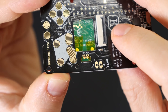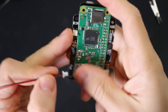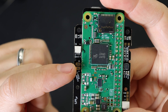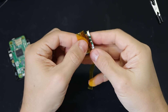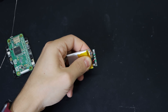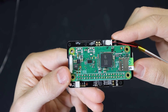Now add a little bit of solder to these pads around the Kapton tape area — that's so the microcontroller on the board is connected to the Pi's USB port. Make sure you don't add too much and bridge the two, they are really close together. Next we need to attach the right kind of connector to the battery. You can just solder the battery directly to the board with the pads below the connector if you prefer. Otherwise, carefully peel off the Kapton tape, fold this tiny board up, remove the leads, and solder on the ones that came in Kite's kit, making sure you get the polarity right. Be careful — these batteries are more than happy to go up in flames if you puncture them or heat them up too much. Put the tape back and fold the board back down and you're done.